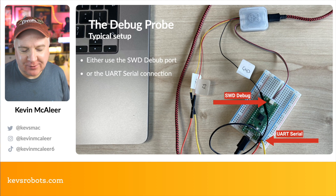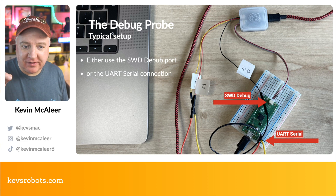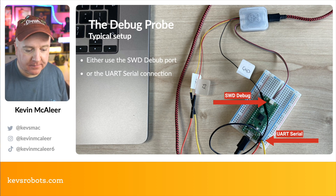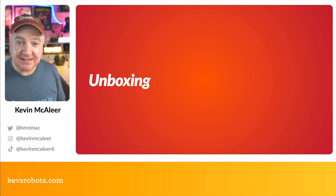Here's an overhead shot of a typical desktop setup: a Raspberry Pi plugged into a breadboard, the JST connector plugged in from the probe, and the UART connectors connected to pins 0 and 1. In terms of wiring, ground is on physical pin 3, UART transmit on pin 1, and UART receive on pin 2 — corresponding to GND, GPIO0 (transmit), and GPIO1 (receive) on the Raspberry Pi Pico.